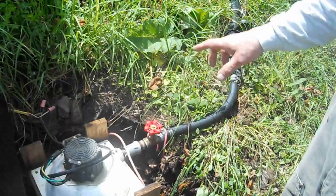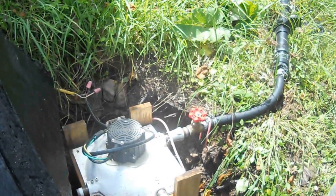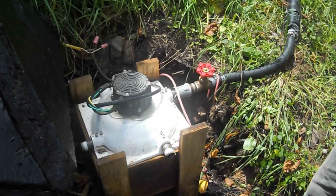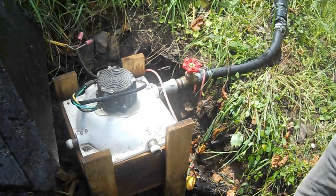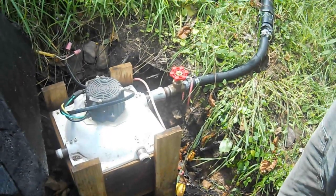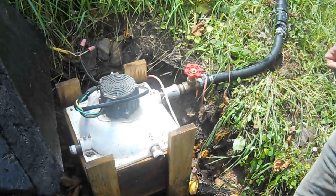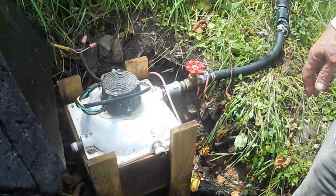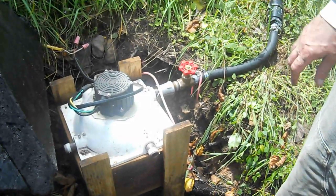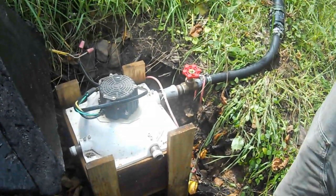The twin — you want to have forces coming at that axle from two sides, so that I can adjust the flow on each of them based on how much flow is coming down the creek at the top, because that's the deciding factor. You want to make sure that you have this pipe full of water all the way to the top, which for me is 110 feet higher than where we are. The amount of water that flows through here can range anywhere from 75 gallons a minute down to 15. We're coming up on the driest month of the year — August to early September is usually fairly dry — and I just know I have to keep the valve closed enough to keep this stack of water fully charged all the way to the top.